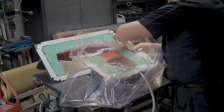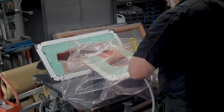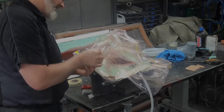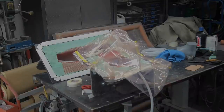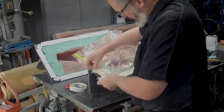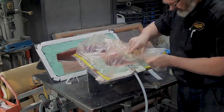Look at the size of that bag — it's absolutely enormous relative to the size of the mold, but this is what I figured would work. Attach the corners first when putting the bagging materials on. I've computed where my pleats should go — about three pleats per side — putting them in right so the pleat line falls directly into the mold, trying to match the perimeter of the mold to the perimeter of the bagging material. You fluff it up lots, look at where it's got to go, then put the tape in. I have another partial video on how to do bagging that I should get released soon.